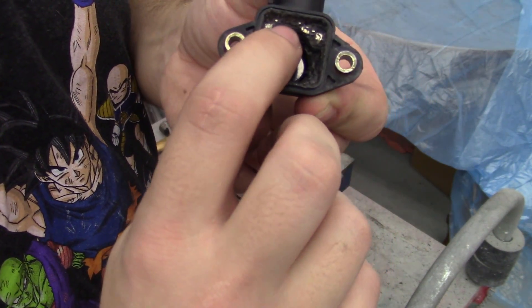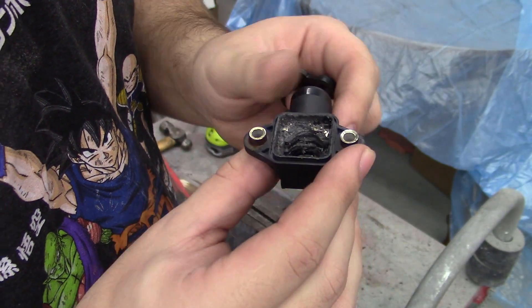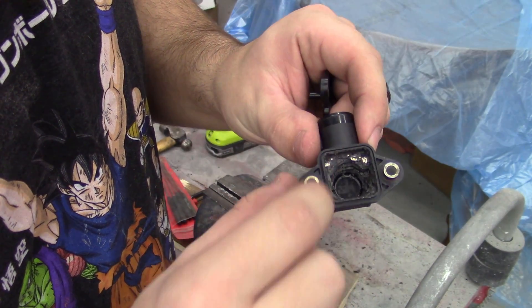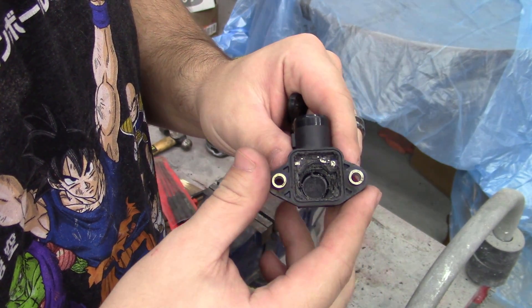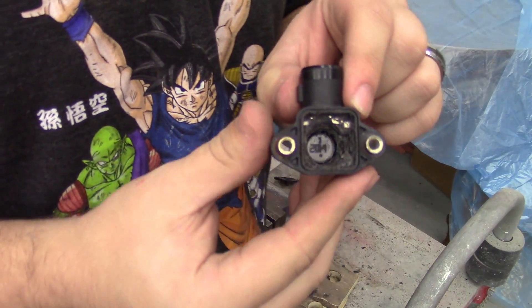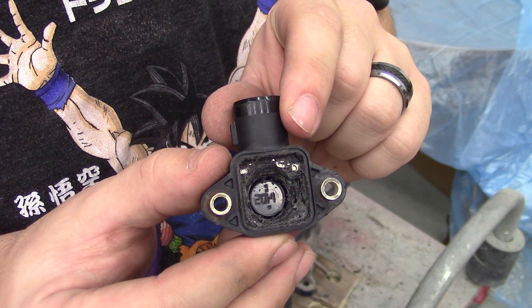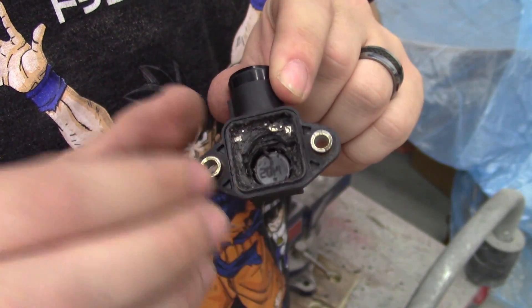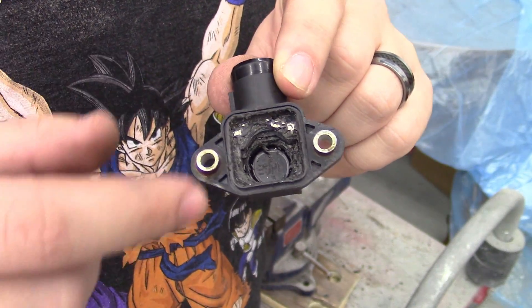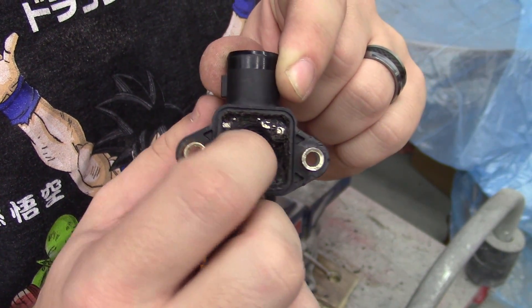These three posts — there, there, and there — are your important things. You don't want to get rid of them. Basically you're just going to start peeling back all the rubber stuff in there. You'll dig at that until you get down to the plastic. Once you've got through the plastic, you can drill out with a 27/64th drill bit — just start drilling and chopping some of it out. You could also use a Dremel. Just start removing your material, leaving the upper part alone — don't touch any of it.